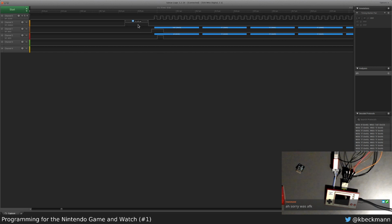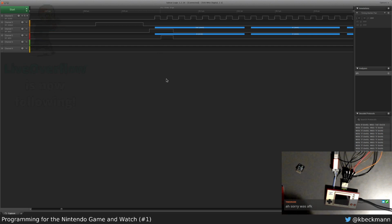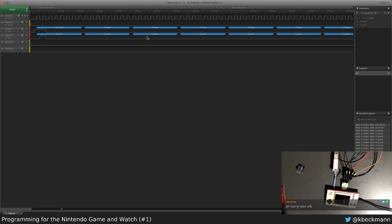We do the chip enable toggling. We send 0x40. Oh, right, because it's in quad mode, I can't really see it. I need to connect the extra 2 bits. But even so, I don't understand why we only get zeros. That doesn't really make sense.